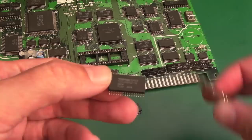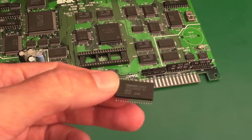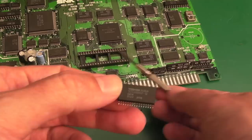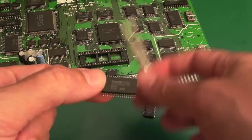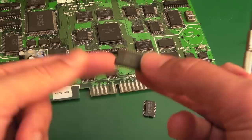Now, in the next video, you'll see that I do get the other board up and running, the one I showed earlier. But I'm lacking an SM1. Now, the interesting thing will be to determine whether we actually need that, because from what I understand, the SM1 provides nothing other than some diagnostic support to the main BIOS. What I mean by that is when the main BIOS boots, it switches this ROM into the Z80 address space to run some tests and initialization, so that the main BIOS can determine the state of the sound subsystem, if you like. So I would suspect, actually, if you didn't have this and used a UniBIOS with the hardware tests disabled, it may work, but we'll find that out in the next video.